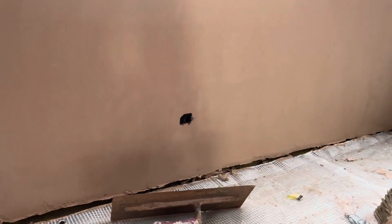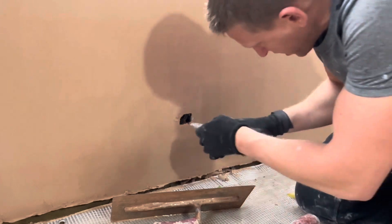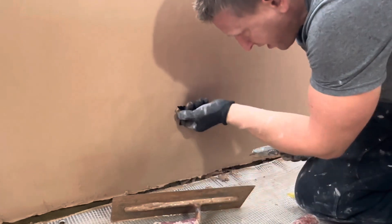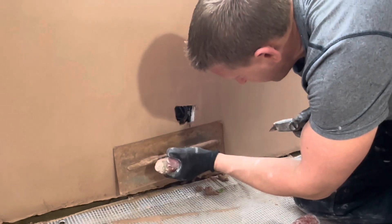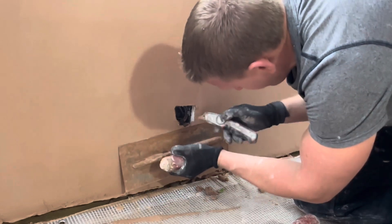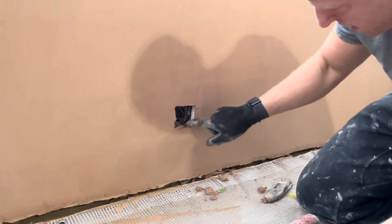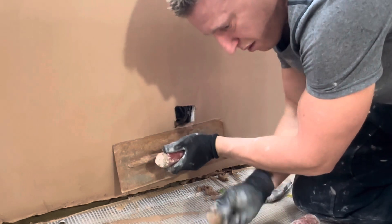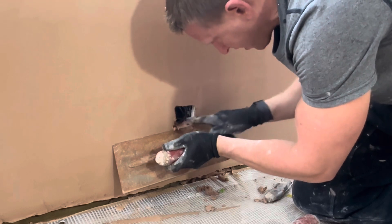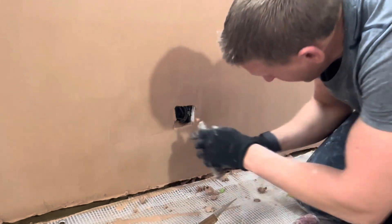So that's what it looks like after two coats. I've just given it a flatten and it's firming up a bit now, so now is a great time to cut it. What I will do is just cut all of it up. Sometimes you can just pull it out, but you can sometimes pull too much away. So what I like to do is find the bottom and use the trowel as a guide. If you do dig out — see I've taken a chunk out there — what you can do is put your trowel back up to the edge and press it in, because it's still quite pliable. Firm it up with your finger, then slide down there and have a flatten, then do the same with the other side.